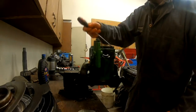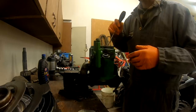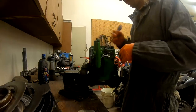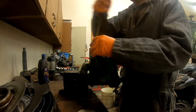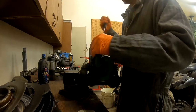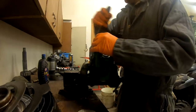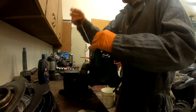After I pulled the pump off again I said I've got to go back and revisit that inlet priority valve — there's something I'm not catching. To be honest, I had to get in the book. There's a little poppet valve of some kind down in the hollow recess of the priority valve spool that I didn't see the first time. Sure enough, it was stuck. After I got that unstuck and got everything back together, I could then adjust the flow regulator spool properly.